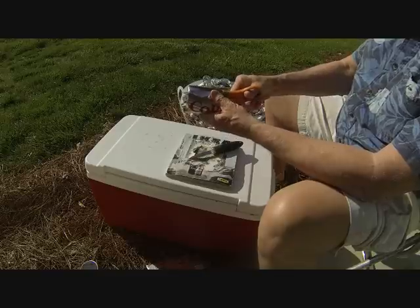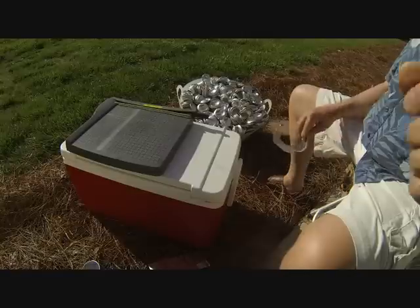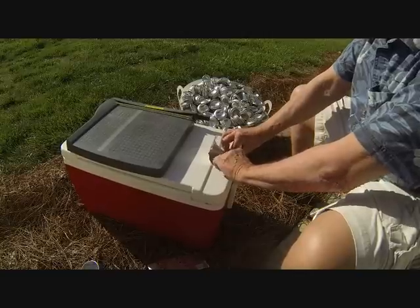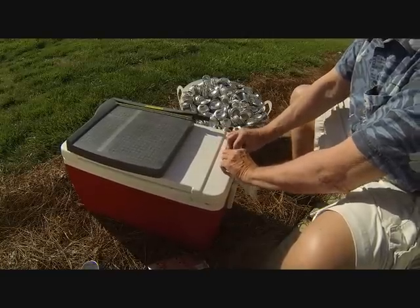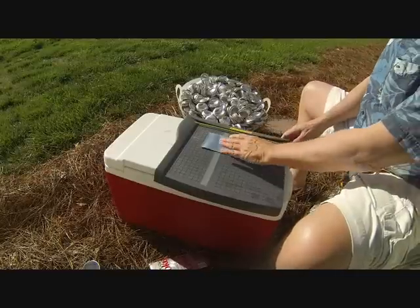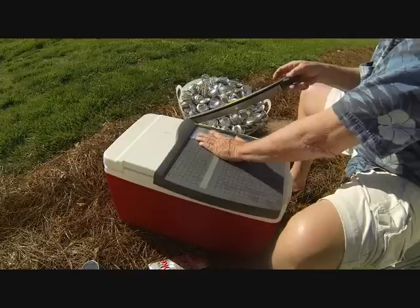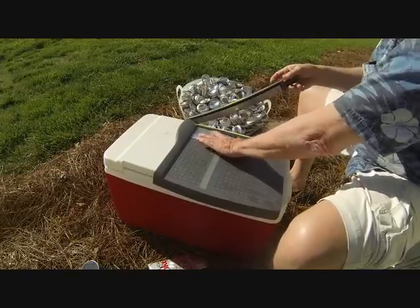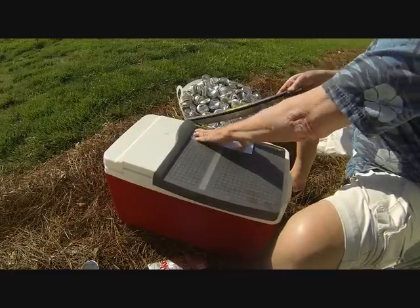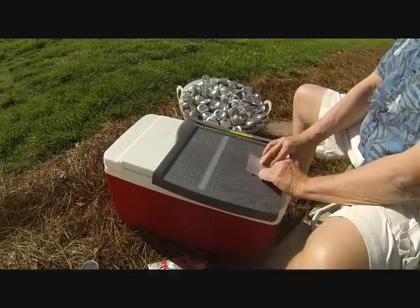Find some straight line on the can and cut with scissors — now you've got the beginnings of a shingle. The next step is to flatten out the can by reverse bending over a radius, as I'm doing here. You can then get the can fairly flat. We then take the can, put it in a paper cutter, and cut it to three and a half inches wide, then reverse bend it a little more to get it flatter.